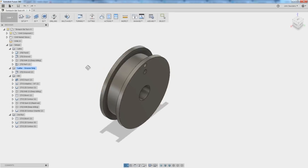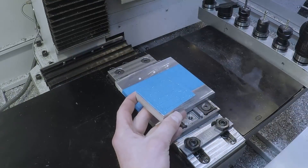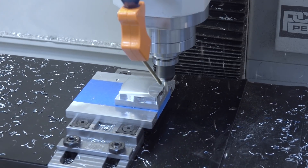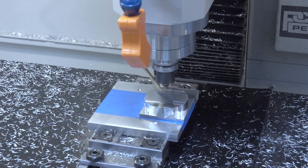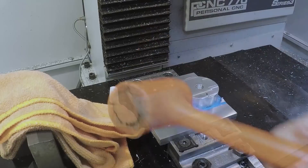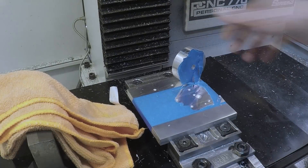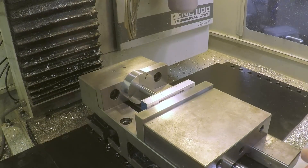In Widget 186, we had to machine a pulley. If you had thicker material you could have just held it in a vise, but the part was nearly the full thickness of our stock, so super glue gives us access to the full part profile. This video shows just how easy super glue really is for one-off style parts. The super glue workholding was great — as demonstrated at the end when we were trying to knock it off with the dead blow hammer. Dead blows usually do a good job of not marring your part, but grab a piece of wood or nylon as a buffer to further help. We also needed to press a dowel pin into the part for the next op, so you can use a traditional 6-inch vise as a press in a pinch.